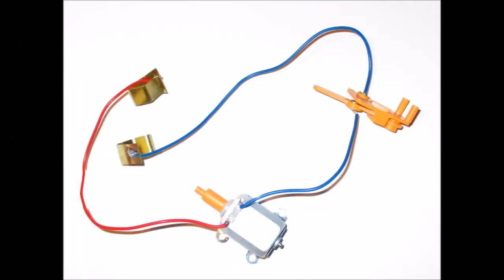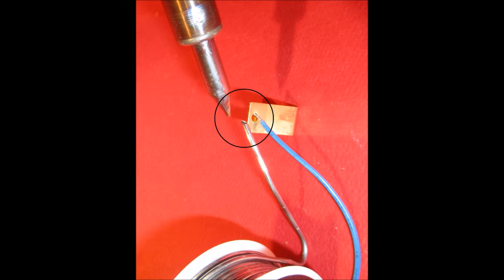Here's what your circuit will look like when it's completed. Note there are two blue wires — use the shorter one to connect to the switch and the motor side. Strip back the insulation about a half an inch from each end of the wires. Follow the manufacturer's directions for the soldering iron, but remember this thing is hot — it'll melt lead. Put the bare wire through the contact points and heat up the soldering iron until it melts some solder onto the wire and connects it to the contact. On the eyelets, solder the wires onto the back side that has been spliced and peened over. Then finish the circuit as shown in the original diagram with all the wires connected to the switch and contacts.